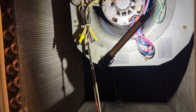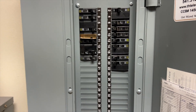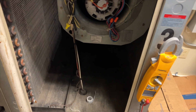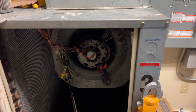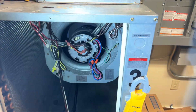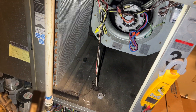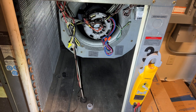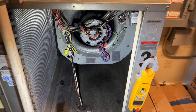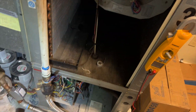We're going to see what happens now. Firing it up. Our fan just kicked on and we didn't pop the breaker, so that may have just been our issue. When you're changing run caps — and I'm sure you saw the date on there — it was almost a little over a month ago. So just make sure if you're changing a run cap, make sure it's secure. That thing was just loose — I ended up having to take the side panel off and tighten that strap. We should be good.